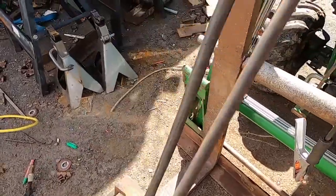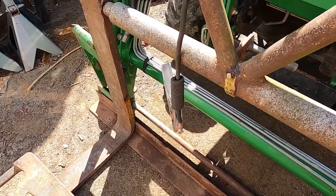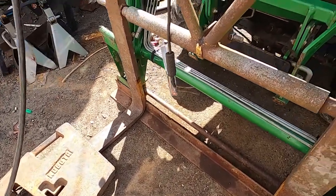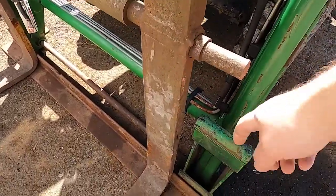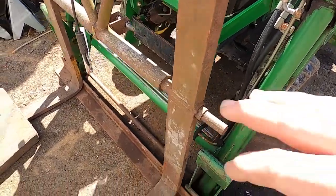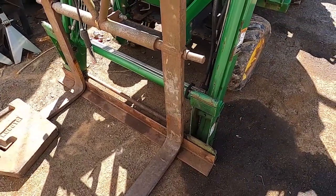The idea is I'm going to weld this to that angle. The forks are very thick. The angle's not, so that's not going to be the primary means of attaching it, but it's going to hold everything in place. Then we're going to come back in, put our hooks on, put our plates in, and weld all of that up. Because the plates are a closer thickness to that, once we bevel those down and clean up those torch cut edges, we should have nice strong welds.